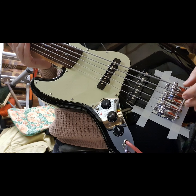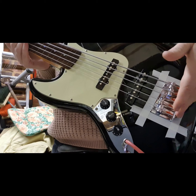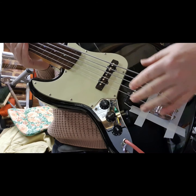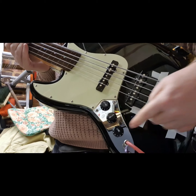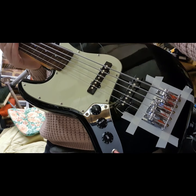Hope you found it useful. If you have a terrible noise from your tone control, it's almost certainly the bridge earth. Check the bridge — if you find there's an earthing problem, do what I did: take it apart carefully, mark up the orientation so you don't lose it, this tape will come off, put your shielding in, make certain of good continuity, solder it back together again, and it should be okay. Cheers, thanks, bye.